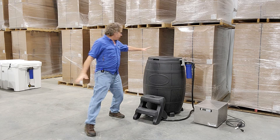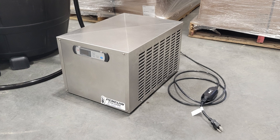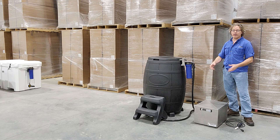The first thing we've got is a system that's going to work with the ice barrel if you already have an ice barrel. What's great about this is that they've got a 7500 BTU, three-quarter horsepower chiller. The great thing about this chiller is that the case is all stainless steel so it will work outside. The more you can protect your equipment from the elements, the more efficiently it's going to work and the longer it will last, but it's okay to just have this as-is — you don't need to put a case around it like you would with other chillers.